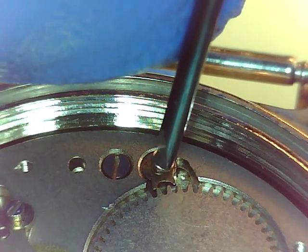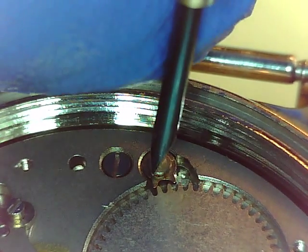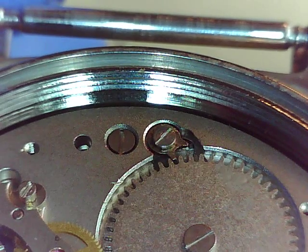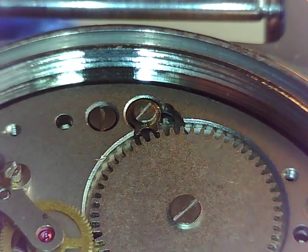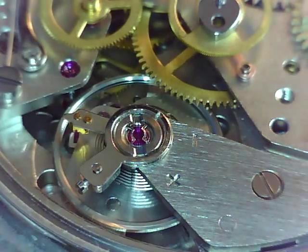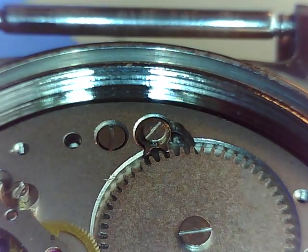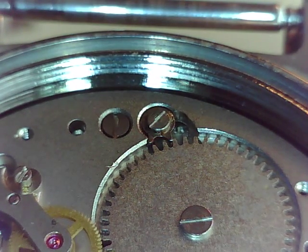When we come back on, our click should operate normally. Quick easy repair on something that most people would think is a big repair or catastrophic. If it doesn't wind, there might be a problem. Look at that — this thing can wind up now. There's that click in operation. It's nice and free, it's lubricated. Our balance is swinging quite nice — that's a good sign too. I'm not going to do a full service on this, because I don't think it needs it — it's too new. It just had a little water contamination causing that rust.